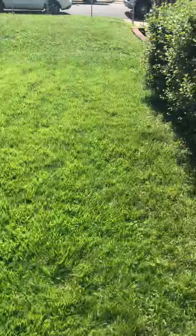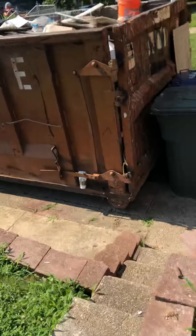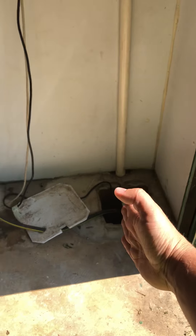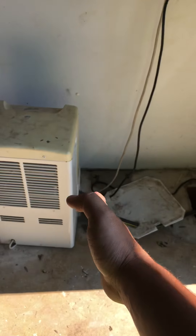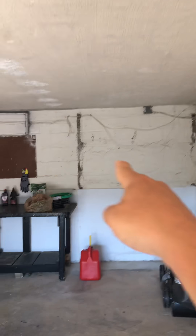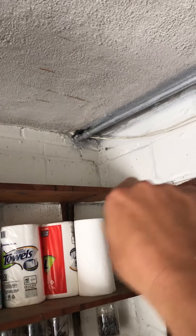Boys are showing up — Corey and Nehemiah have already walked this one through with me. We're looking at this pit, installing a new crock and bringing it over. Want it out of the way. So I'm going to bring it over just enough right here, and we're going to run a line up and around the wall. We're going to go in between the drip leg of that gas line — literally in between that arch — and run the line through, then exit the house right around here.